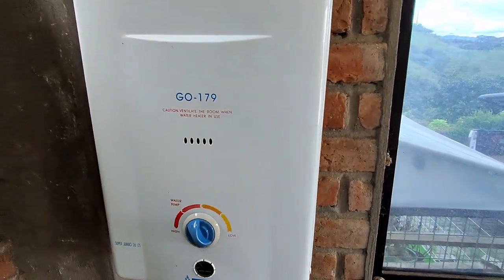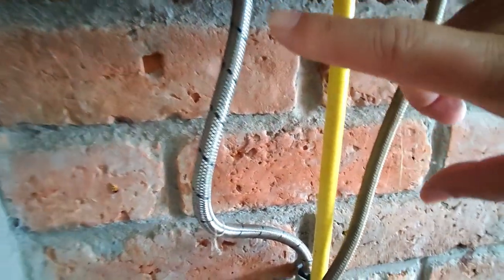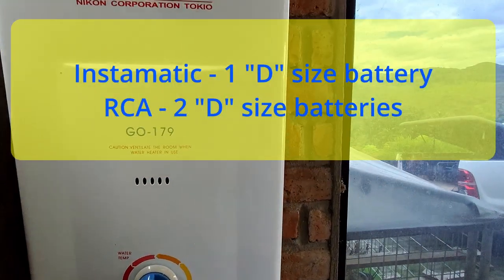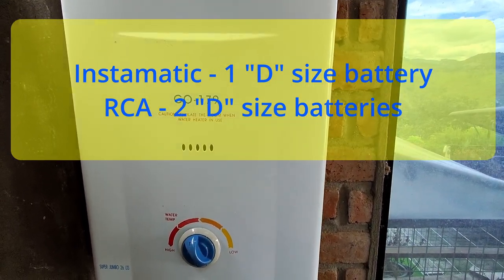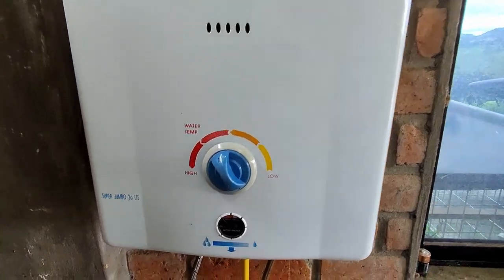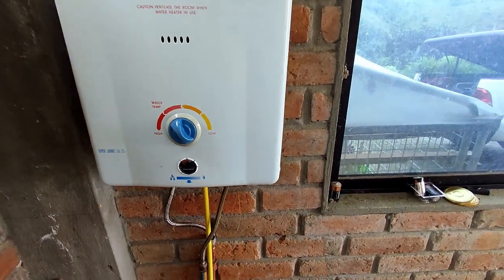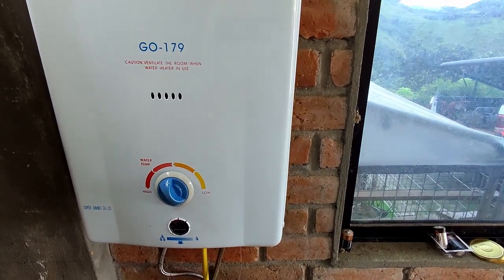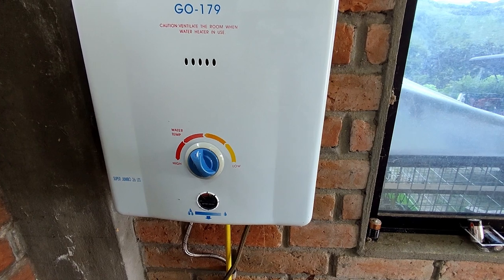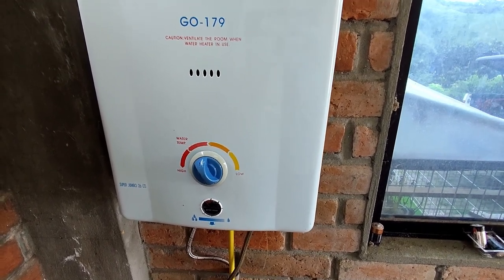The things that can go wrong are your batteries inside. The Instamatic takes one D-sized battery, which goes in a little drawer right here. The battery starts the igniter — as soon as the water kicks on, that igniter goes tick, tick, tick trying to light the flame inside. If you turn the hot water on and you're not getting any hot water, you come out and there's no ticking, and you'll see it's stuck on the red side — you'll know your battery's bad and it's time to replace it. The RCA heaters actually take two D-sized batteries. So: Instamatic, one D-sized battery; RCA, two D-sized batteries.